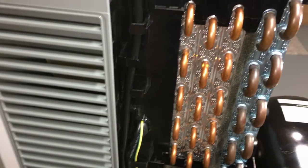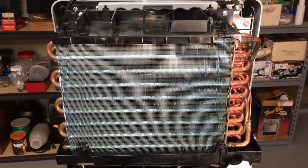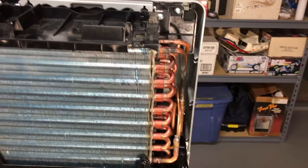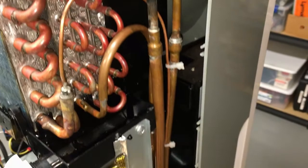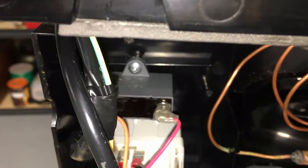That's something we're up against because R410A operating at very high pressures uses very small coils and gains a lot of efficiency that way. So the first thought was to use R290, because obviously it's available in the refrigeration section at your local camping department. The first experiments revolved around using R290. We did have to change the cap tube from the 410A unit — this has gone through several iterations of size and length. We have a dryer down there, it winds back up, we have a start relay, and that's the fan capacitor there.